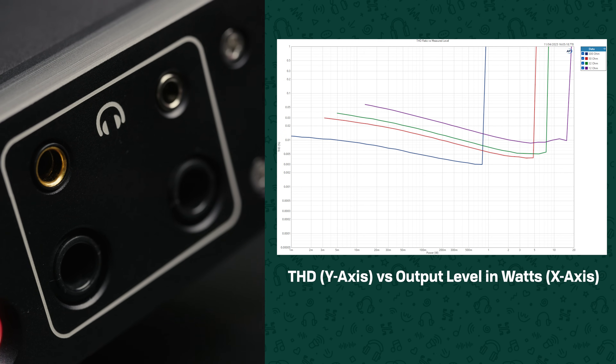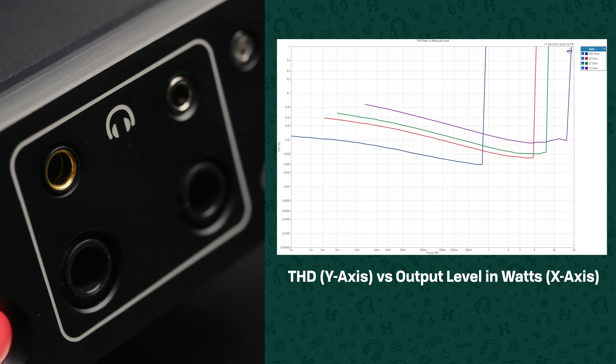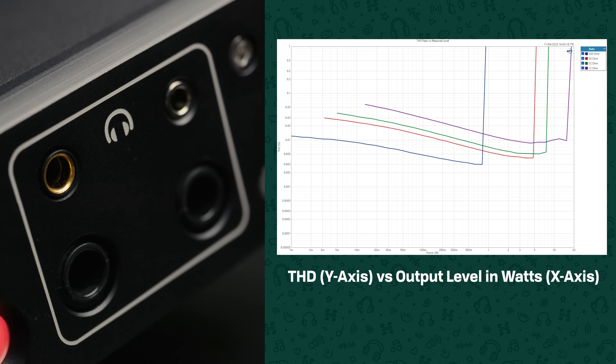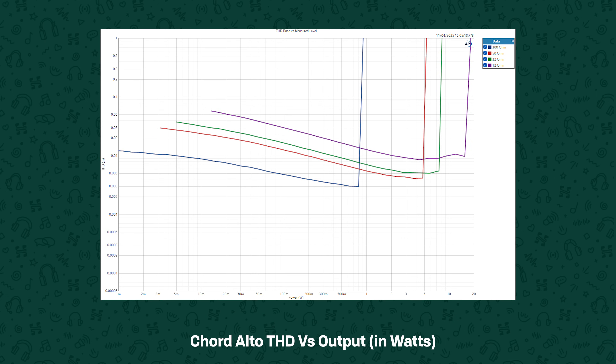For the headphone outputs, I got just over 7W into 32 ohm and around 16W into 12 ohm, and there's also no signs of rising distortion as we go towards the upper output levels, which is something which can be a little bit misleading about some other amps. A lot of amplifiers, even if they can deliver lots of power at maximum, can still be distorting way more at 2 watts than they are at a tenth of a watt. On the screen now you can see an amp which can do quite happily 5 watts at 32 ohms, but it's still distorting significantly more at just 2 watts output than it is at about half a watt. But the Alto seems quite happy right up until it hits its maximum voltage limit.